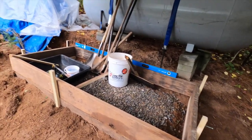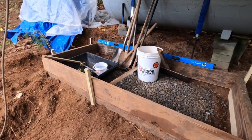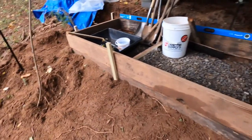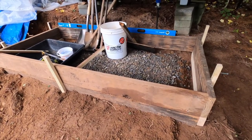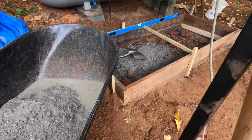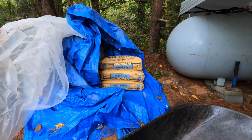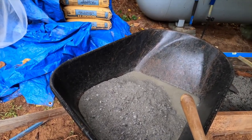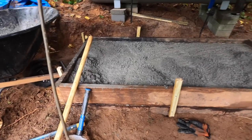I put a little bit of gravel in yesterday and I'm going to put more gravel and rocks in as fill today. I also need to clean up the little trench around the outside so the concrete along all the edges goes all the way down. I've got one 80-pound bag done and I'm working on my second. I'm doing one bag at a time — this is Quikrete High Strength Concrete Mix, 80-pound bag, about $4.82 a bag. Please like, comment, and subscribe.